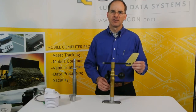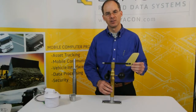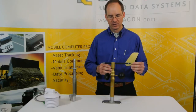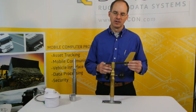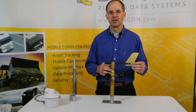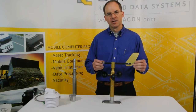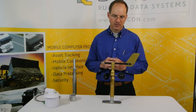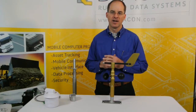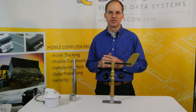Some of the advantages of the Diacon wind sensor include the construction, which is anodized aluminum. We also incorporate ceramic hybrid bearings — custom specified bearings to meet our needs for low turning torque and longevity. The wind vane, instead of using a contact potentiometer like most wind sensors, uses a non-contact sensor, enhancing the serviceability and useful life of the product.